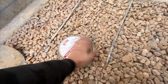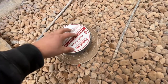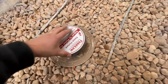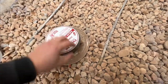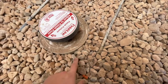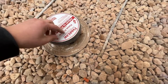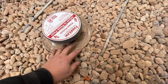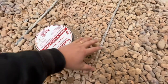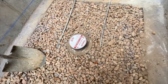Here's the actual drain. This is a piece of plastic that comes from the factory this way so we can pour the concrete and then peel this off later to keep it clean. This drain is connected to a five-gallon bucket that's turned upside down and has a lot of holes drilled on all the sides, so that allows the water to come in here, down into the bucket, have a little bit of space to fill if it needs to while it's percolating into this gravel, and then from the gravel field into the soils below and around. That's how the drain works to allow the water in.